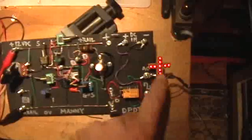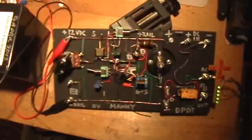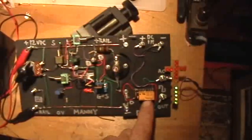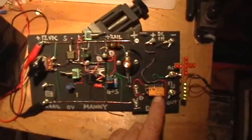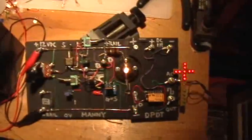Any circuit that requires plus or minus just about any voltage swinging according to a time schedule that you establish — fast or slow — can be performed with this circuit with, I guess, about $15 worth of parts in there now. This little relay is $2.50 from any number of suppliers on the internet. It's a 6-volt double-pole double-throw relay.